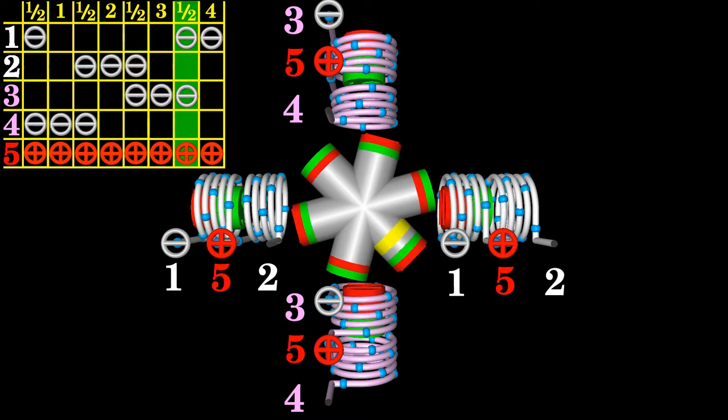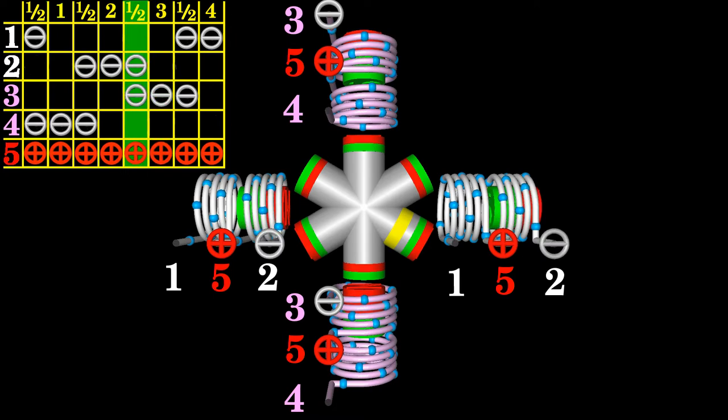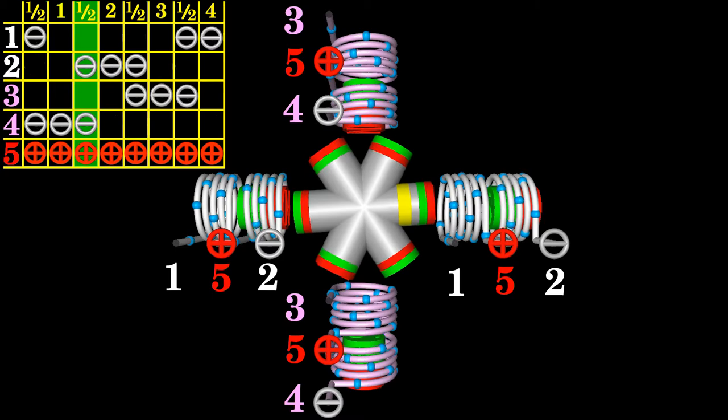This motor can also be commanded in half step mode. Even in this mode, no more than 50% of the windings are energized at the same time during operation. Unipolar stepper motors only utilize half of the coil length, so less torque is available to magnetically move or hold the rotor in place. To get nearly the same torque as with the bipolar type, twice the number of windings is needed, which is why unipolar stepper motors are usually larger.